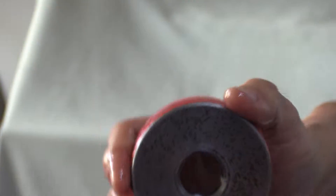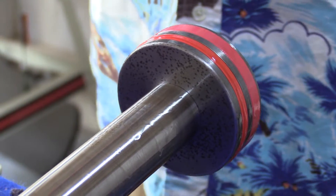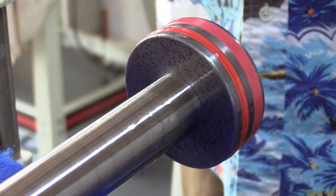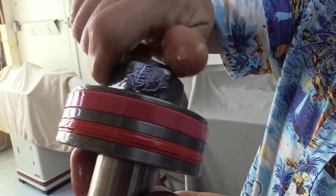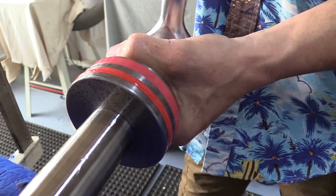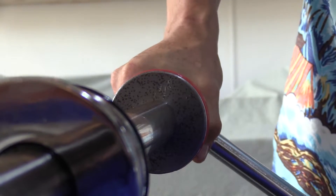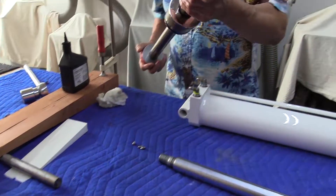There's another rubber seal in there as well, which sits against this — so it's an additional seal. All your hydraulic fluid stays basically on this side of it, keeping all the fluid out. Then we simply put the nut on and tighten that big nut up. Now that that's tightened down and we've torque set it up, we're going to slide this in accordingly.